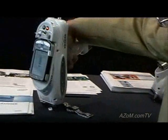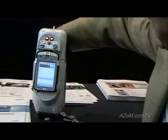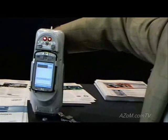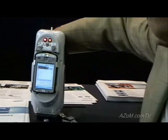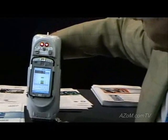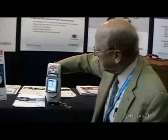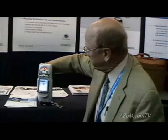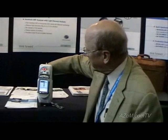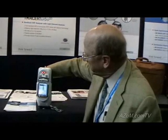With no changes in settings, I can go directly to an aluminum sample and measure it. This takes a little bit longer period of time because this involves the measurement of some very light elements, very low energy X-rays. But in about 15 or 20 seconds, the instrument will give us a good chemistry and alloy identification on this aluminum sample.